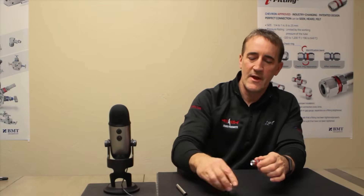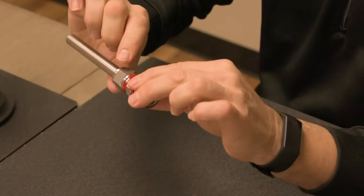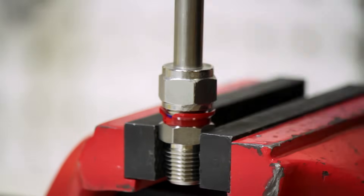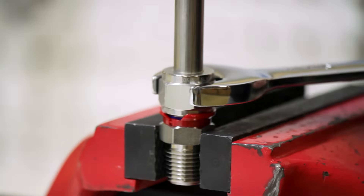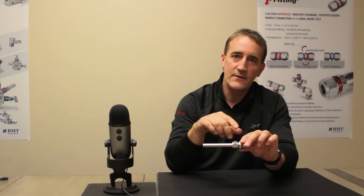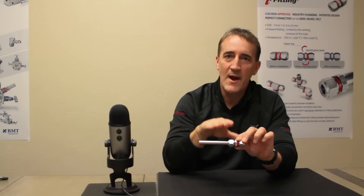I'm going to remove these ferrules and give you a demonstration of what a gap gauge fitting does. With SuperLock, you take the tubing, insert it into the fitting fully, and start tightening the nut. You tighten with a wrench until these red rings pop away. These red rings are an amazing new built-in gap gauge. This eliminates the need to carry a gap gauge, and most people in the industry are not using a gap gauge to install fittings anyway. Now we've eliminated the need for a separate gap gauge — the distance is always correct, it's not over-tightened and not under-tightened. It's tightened at the exact right spot every time for maximum seal and safety.